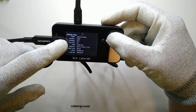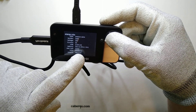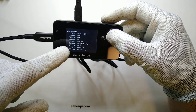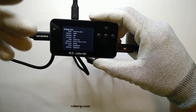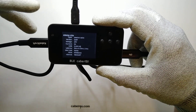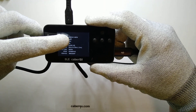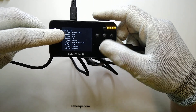Now the e-marker info — that's where it gets interesting. Funnily enough, it advertises itself as a USB 2.0 cable at a length of around three meters. This is interesting because the standard itself does not define an e-marker info where it says the cable has no data at all, so it just advertises itself as the lowest data speed available — USB 2.0. The latency doesn't matter at all because there will never be any latency, so I'm not sure what they put in there, but for some reason they set it as a three-meter latency even though it has no data. The rest is correct: current at 5 amps, voltage at 20 volts, and the vendor ID is 2E87 — which is interesting because I don't know if Kabelkraft actually has a USB vendor ID, so I'll definitely look that up later.